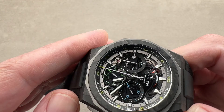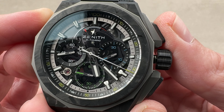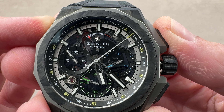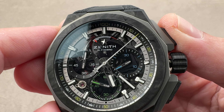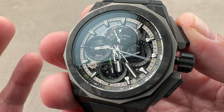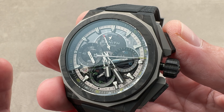This watch has a lot to offer, and of course we haven't even talked about this foudroyante. The idea is that if you have a 100-beat-per-second chronograph escapement, you can resolve one one-hundredth of a chronograph second — just like F.P. Journe's Centigraphe Souverain. I can read tenths and even hundredths of seconds. Right now, I have seen the elapse of thirteen hundredths of a second right there — that's how you read it. Each second broken up 100 ways, just like the Journe's Centigraphe, but for tens of thousands less. It has a unique sound against the ear: not only does it have two heartbeats, but the foudroyante escapement sounds almost like a hummingbird. It's very distinctive — a unique sensory experience, a treat for the eyes and ears.